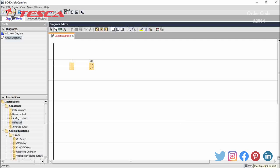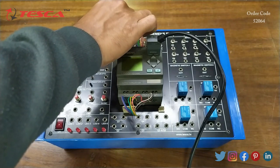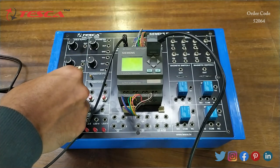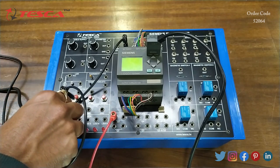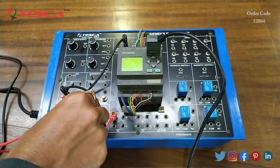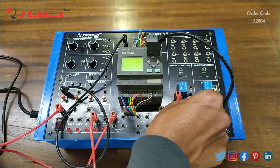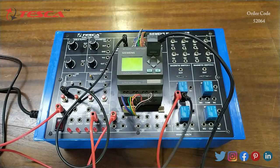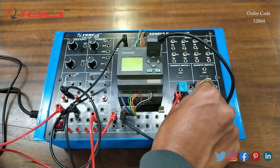We again check the model, which is 0BA3, same as the PLC we are using. Now we will go to the kit and do the connections. Firstly we will connect one input I1 to the push button. Then we will connect Q1 first port to the 24-volt supply. Then we will connect one of the LED outputs to one of the relay NO contacts. Then we will connect the common port of relay 1 with the 24-volt supply. Then we connect Q1 second port with R1 of relay 1.